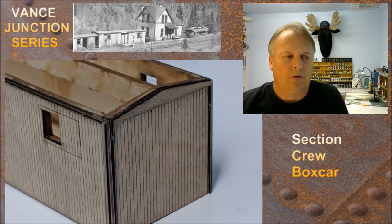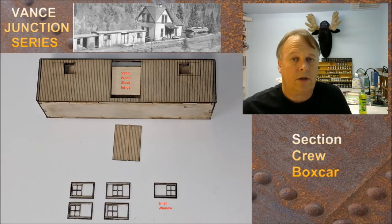Once the plywood ends and sides are all squared up, it's time to start the trim. The triangular piece on the end at the top goes on first. Since you don't have a lot of extra material for the narrow trim piece and the wider trim piece, make sure you add those first and make your cuts very exact — plan them out a little bit. The thin trim pieces go on the ends, then the wider pieces go on the sides, and there should be enough thin trim to go along the top just over the windows on the sides.